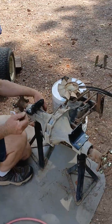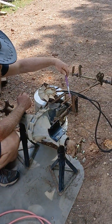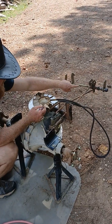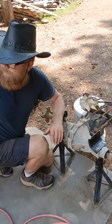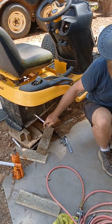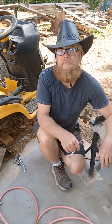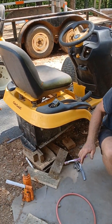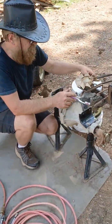What I noticed is it wasn't simply a matter of replacing the axle — the linkage was different, this brace is different than the SLTX, and even that crossbar there is different. But the mounting point and all that is the same — the frame is identical. This is that nine-gauge frame that is fairly sturdy, especially in the rear section, compared to a lot of what you see now as fewer actual garden tractors exist. The holes and drills and so forth are identical, so it should just be a matter of swapping over the unit and ensuring the drive belt is the same length.